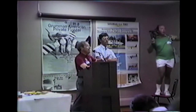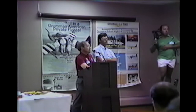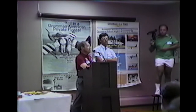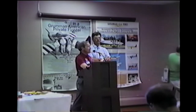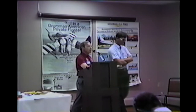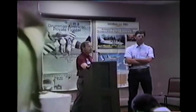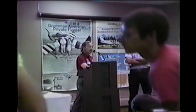We're out of time. Like I say, something that you can hook up there that's easy to come off. Frankly, if you rig up something like that, it's probably going to get sucked out. If you do open your canopy in flight, be sure to make sure all your shoulder harnesses and everything are tied down, because it'll beat the heck out of the side of your airplane.